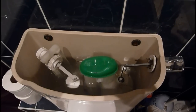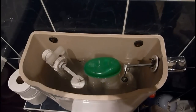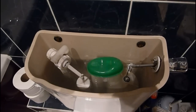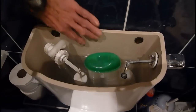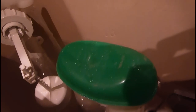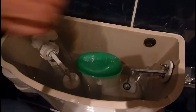Before we start seeing an arising problem. Right, there we are — she's shut off. What can you see immediately that is wrong? Now, if you look here, there's a line. That line is the water line that the water should be at for this system to flush properly. All systems have got a line like this. A lot of times cisterns don't flush properly because there's not enough water in the system.